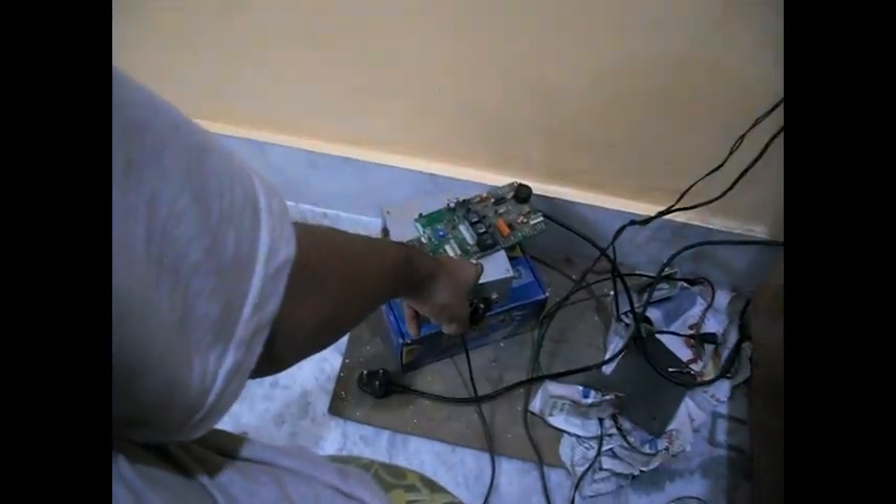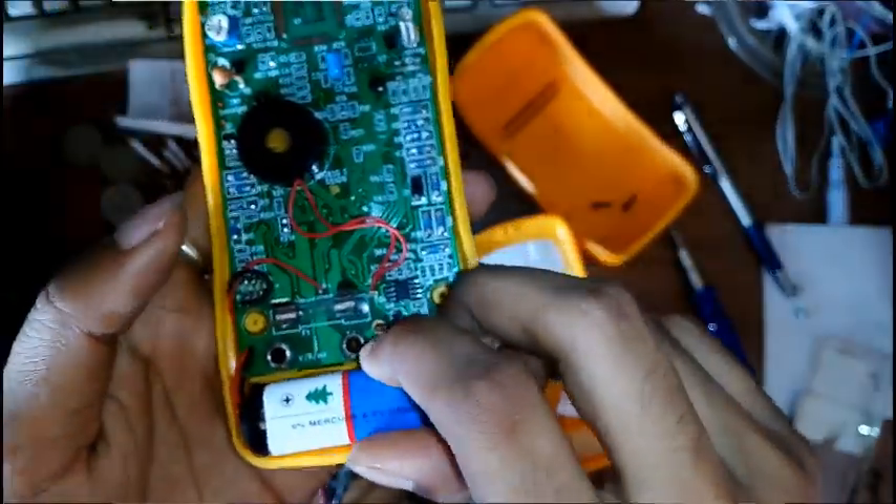Like greater than 10 amps — my power supply can deliver up to 16 amps — which can kill my multimeter if it's unfused, and it is. So I have to be careful. Anyway, I think I'm getting out of my target area, so let's replace the battery.